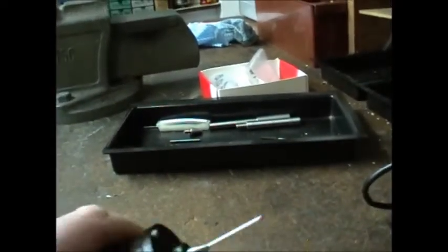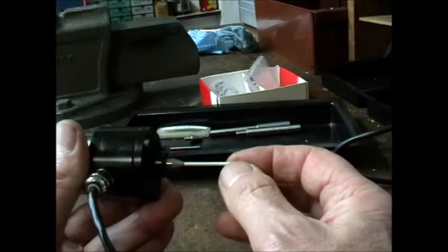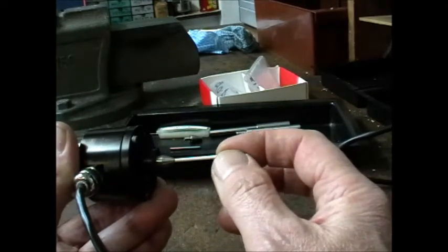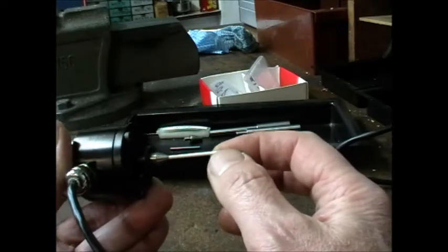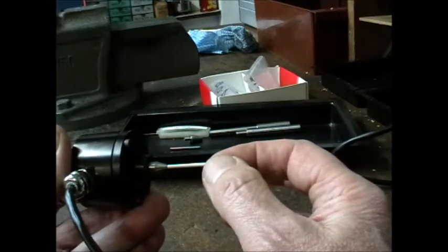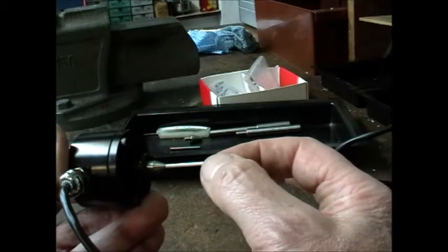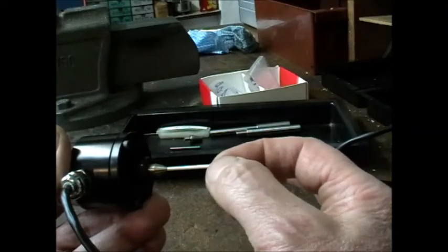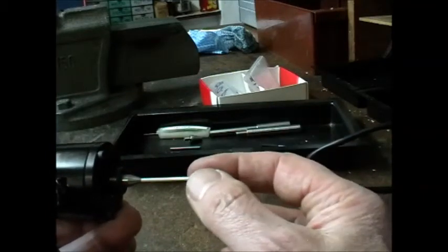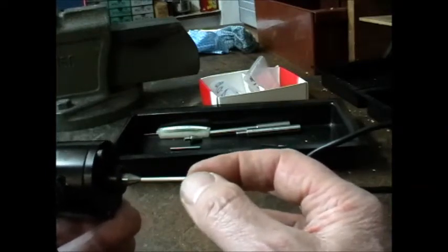Let me try and demonstrate this. The two different directions, or all the various directions of the internal swing arm — deflecting it out of contact in both the X and Y plus and minus directions. You can actually feel the swing arms breaking away at different pressures. I've measured that: in one direction it's about 140 grams and in another it's about 110 grams. That's a problem because this long flexible stylus bends about four thou in one direction and about two thou in the other, so you can't use it as it is for accurate work.